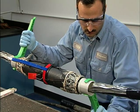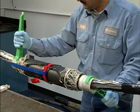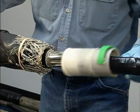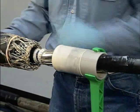Twist steadily about 180 degrees to release the short carrier tube. The short carrier tube will eject itself on the side opposite the blue straps. Then reposition the splice body one inch from the end of the body to the edge of the neutrals.